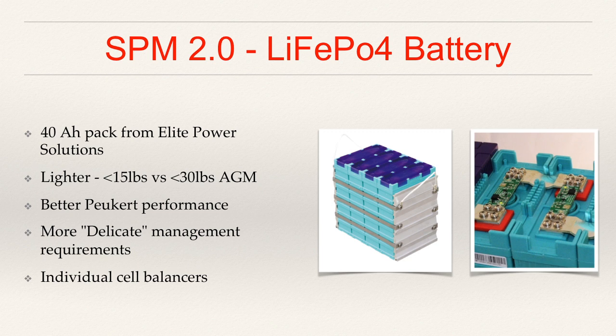There are more delicate management requirements. On the low side, we can't let the pack get below 11.2 volts total, but I intend on shutting everything off at 12 volts, which gives us some headroom. We also have to prevent overcharging, which the cell balancers help with, as well as the charge controller cutting off at 14.2 volts. The cell balancers kick on when any individual cell gets above 3.55 volts, turning on a transistor and dumping the extra power as heat — so they're top balanced. They're discrete components installed between the positive and negative terminals of each cell, with no true battery management system.